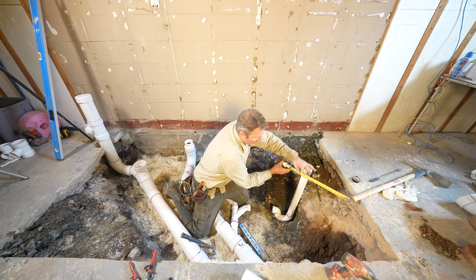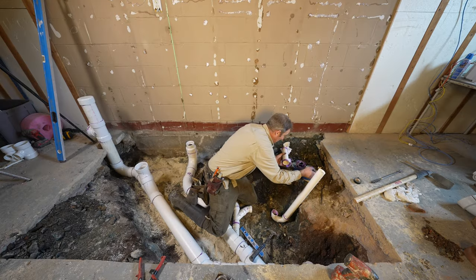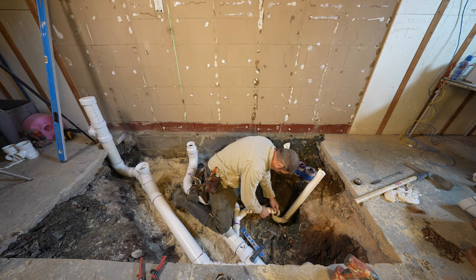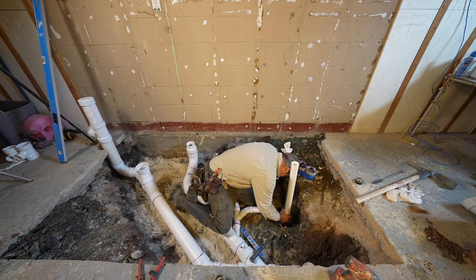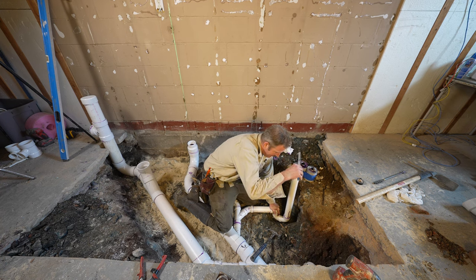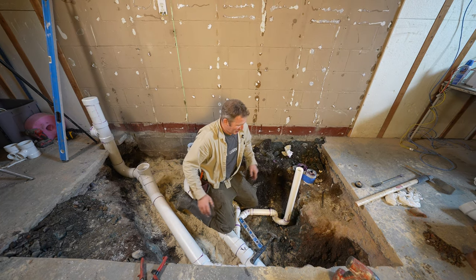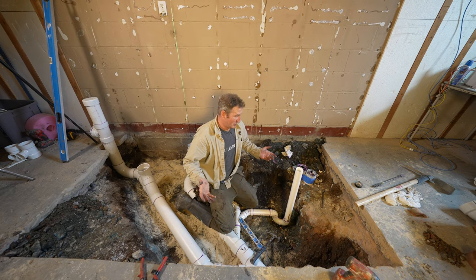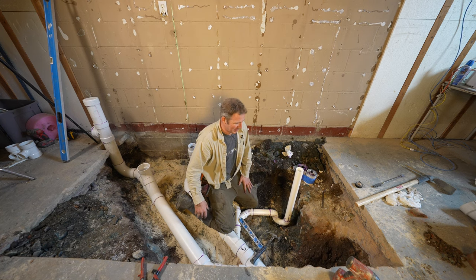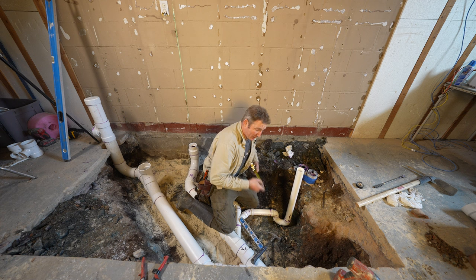Okay, so this is the edge of the wall, so 24 by 18. I'm 1 inch off. Tell you what, if you were to do a different type of shower pan, which, you know, I really wouldn't recommend anything other than doing a mud bed, just because you already have all this concrete busted out and there's no sense in getting a preformed base. But I'm like 19 inches off of my edge of my wall. I'm centered. I'm 24 this way.